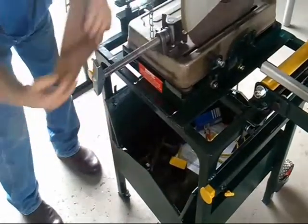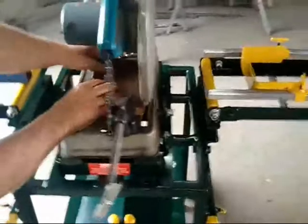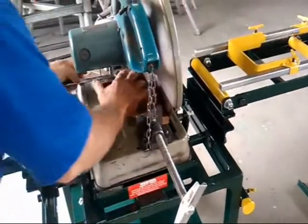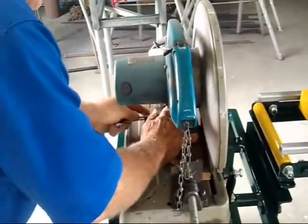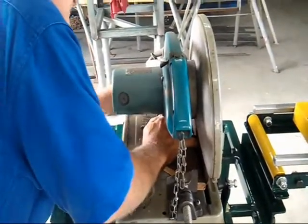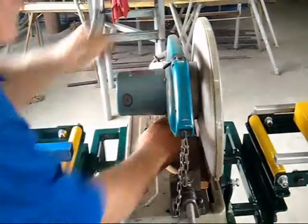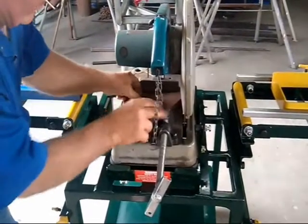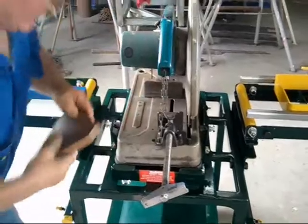To make sure I've got my correct angles, I've cut myself a block. That's the square. Once you go against the stone and up against the back jaw of the vise, that's perfectly square. Now that's when I can tighten the bolts. When you're cutting the 45s, you turn it like that, and you put that part against so you can get your 45s perfectly too.